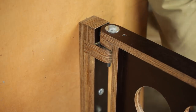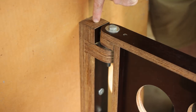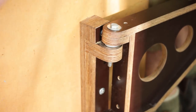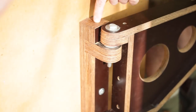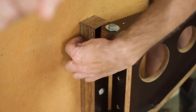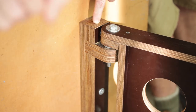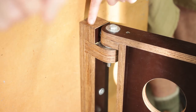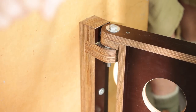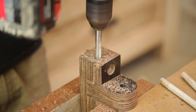When the seat is straight out and you put weight on it there's no problem — this piece is just pulling against the dowel. But when you put it around one of the sides and put weight on it, this piece here is twisting and pivoting on the dowel, and that's why that glue line at the back is broken. What I should have done is put two dowels in further apart — that would have held it, it wouldn't have been able to pivot, and it may have saved the glue lines. Adding more dowels was a bad idea though because they were too close to the edge and I ended up blowing out the side of the plywood.